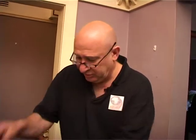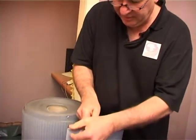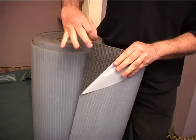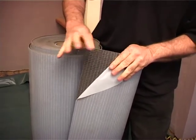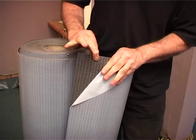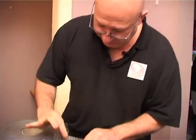Right, this is the sticky elastic mat that we're going to do with a permanent bond. Just want to show you, this particular mat has some strands of reinforcement. This is to ensure that the adhesive does not delaminate from the mat. So be sure to use a top quality one that will not delaminate and will be a permanent bond. Right, now we're going to roll out the sticky mat right through the floor and then we're going to start laying. So let's go and do that.